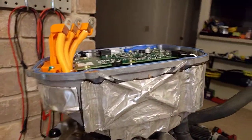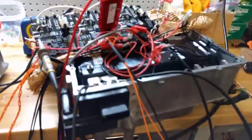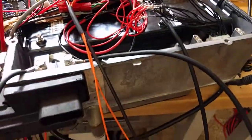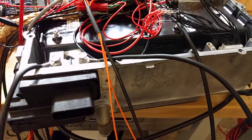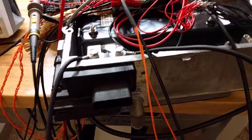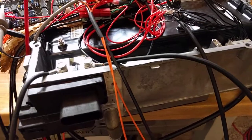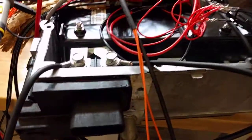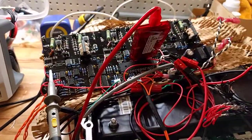There's the inverter, which we're not using at the moment. We are currently using a 2011 Hyundai Sonata inverter that we reverse engineered to get practice before hacking the actual Tesla one, and it's turned out very well. It's just a little 20 kilowatt power stage from the Hyundai, which we're driving with this motor controller.